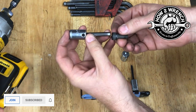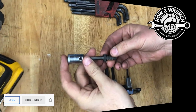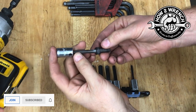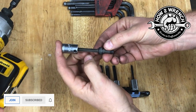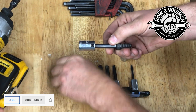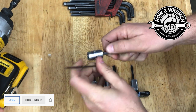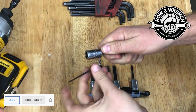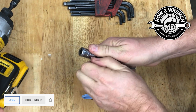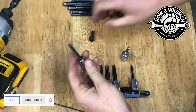So what we want to do: number one, have good clean fasteners and clean tools; two, make sure you have full depth contact; and then lastly — the part I think people miss out on — just go in here and snug this set screw up so that we take that free play out of there.